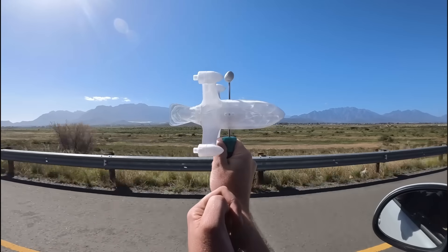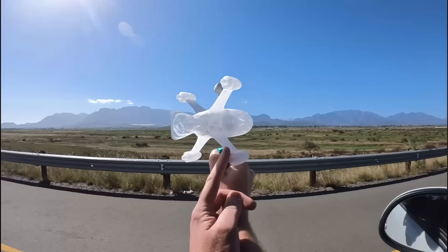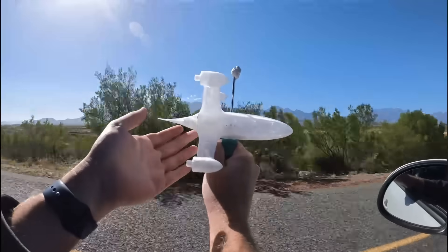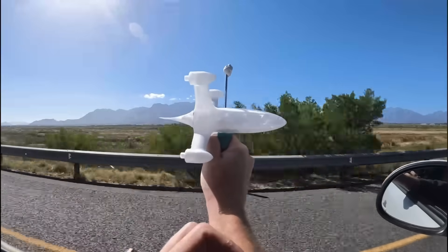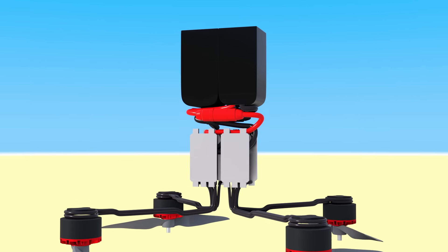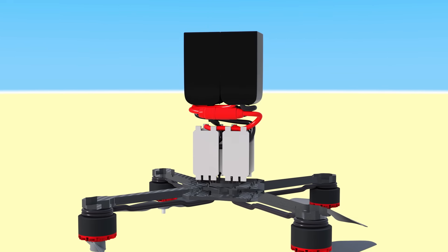The batteries were stacked one above the other, giving it a rectangular profile. In the side-to-side motion or yaw, there was a large body surface area, and this required a tail to keep it straight. In the nose up or nose down direction, the exposed area was less — it was naturally stable. The size of the tail was worked out by good old-fashioned out-of-the-window wind tunnel testing. During test flying, Luke felt better control with the tail than without. The redesign had the speed controllers placed under the batteries on the forward side of the frame, which required legs for the batteries.